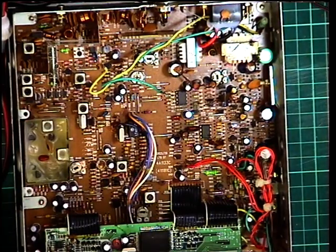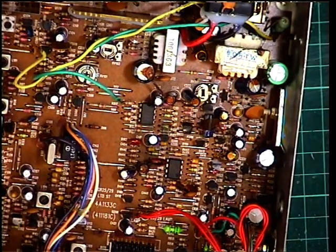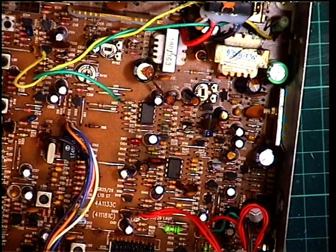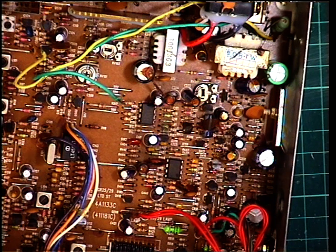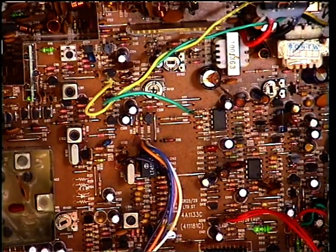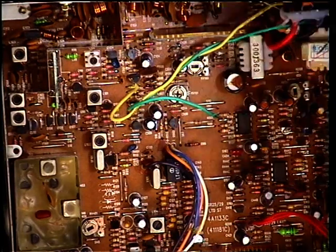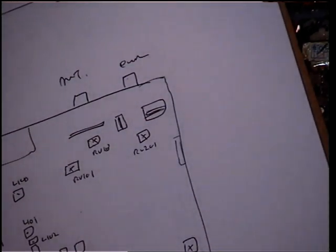I am right — there is a power regulator. I'll use the yellow tool and I hope we can see that. It's the preset down there which is RV203. I've now got full 4 watts — in fact I've just got it over. It goes down to just under 2 watts and just up to 4.2, so we just set that spot on 4. We've optimised the transmitter and set the power to 4 — that's really good because it's not often we get CB radios that do real 4 watts instead of a kind of perceived 4 watts into a cheap meter.